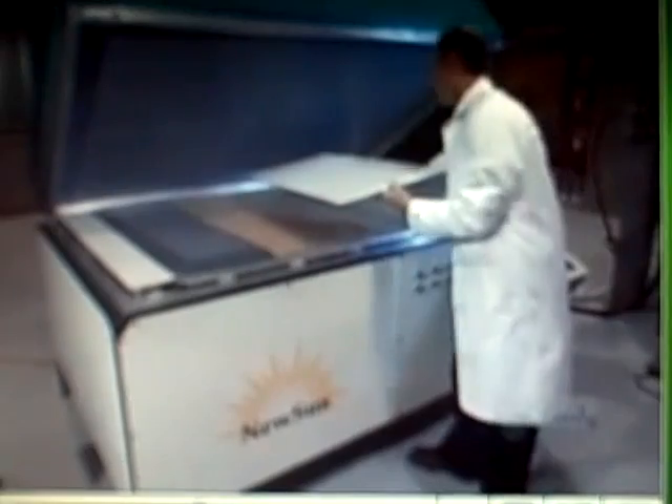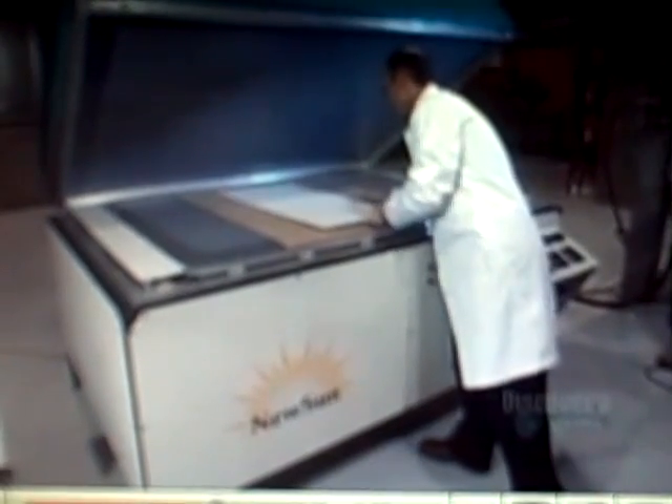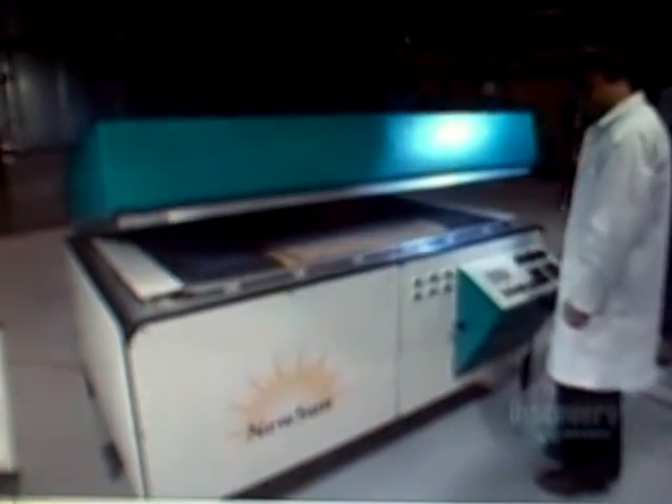Superposing of parts forms a laminate, which increases the rigidity and solidity of the panel. Finally, a sealing film is applied to protect the module. To laminate and stiffen the solar panel, it's placed in a heated oven from which air has been vacuumed out. The panel will cook at 80 degrees centigrade for 15 minutes. The oven hermetically reseals to proceed with the vacuuming out of air.